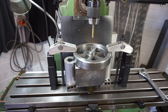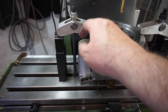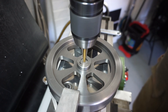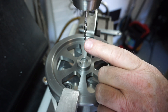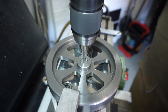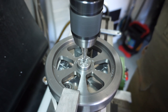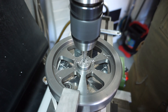Here's my work holding method to hold that motor in situ and clamp up on it — I've got round aluminium tubes and clamps. I found centre using my dial indicator and found the centre of the work. Let's spot drill, then drill. This is my 4.2mm drill bit — I'll be tapping this M5 by 0.8 pitch. I want to go about 12mm deep. I'm looking at the increments on the quill lever — it's not super critical. I'm down to 10mm, 11, 12, 12 and a half.